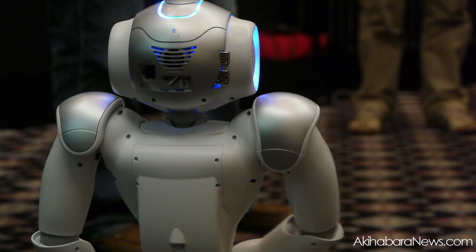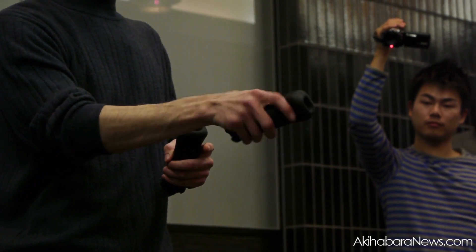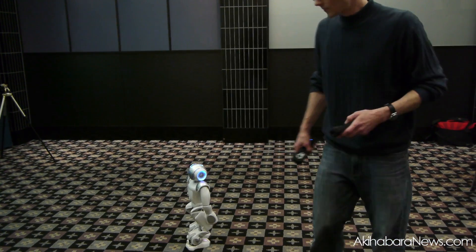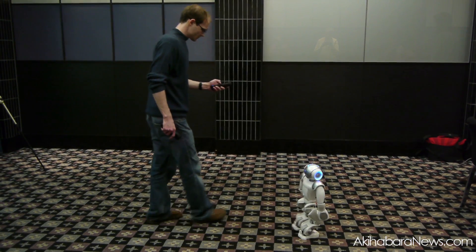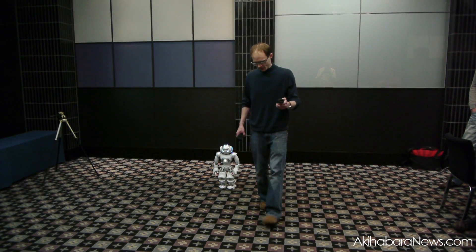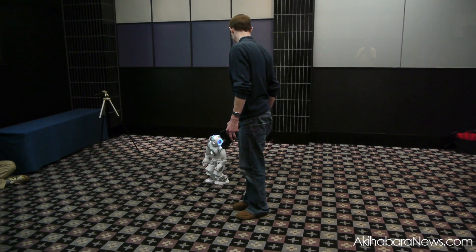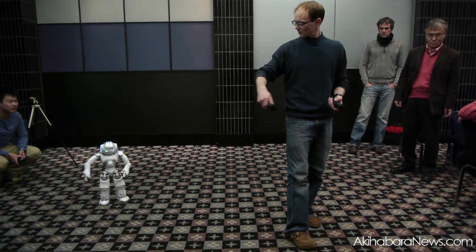Using the motion proxy, I am directly controlling each individual joint of the arms to match my joints as close as possible. The Kinect can't track wrist data, so I am using the rotation of the Wii remote to control the robot's wrist. Then this button starts looking at my position and the NAO will copy my walk. I can see where he's going — let's see if the ending position matches. I'm using the move-to function in ROS — the Robotic Operating System — it's a new effort.